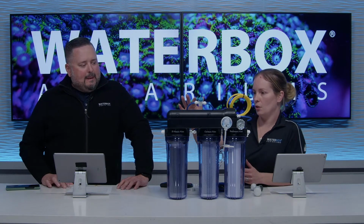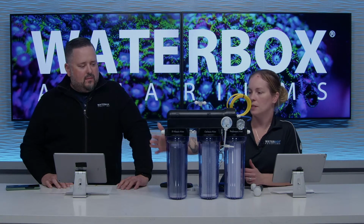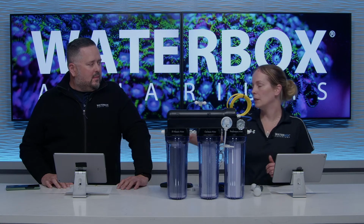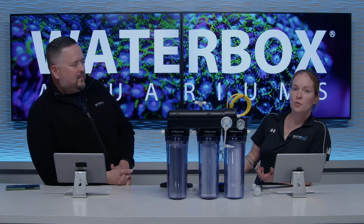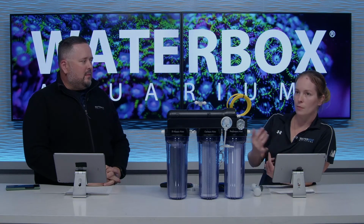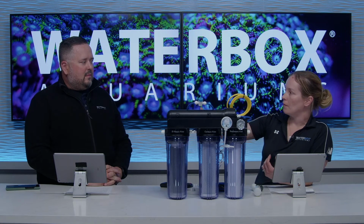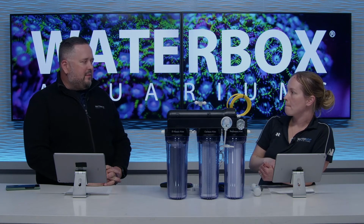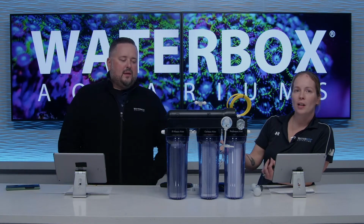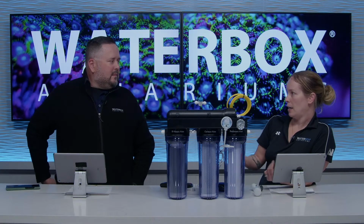We do also have the 5-stage. So this is the 4-stage. The 5-stage has 2 DI cartridges that go in line. Usually, the more water you're making, it's just better to have that as double redundant in case one gets exhausted. You have the backup. You're going to have to change it less, especially since here we run the double DI because we're making a lot more water.